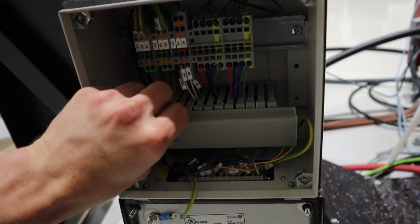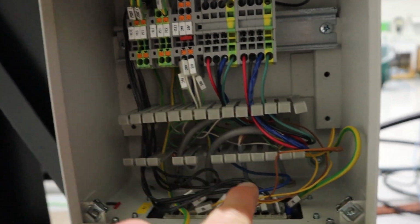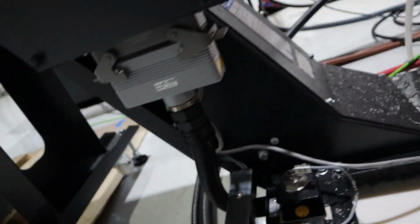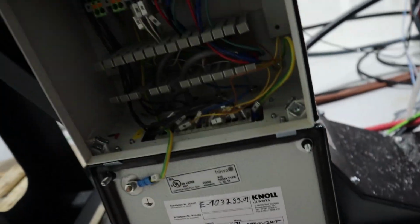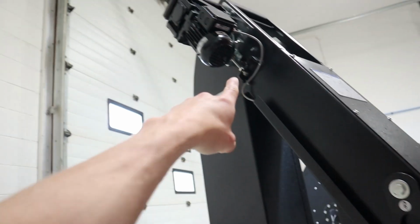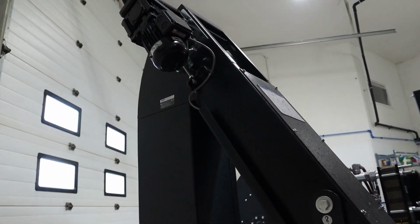But if I pull off the cover that covers the wiring harness, I can see those little white wires end up going to those 2 thinner gray cables, which, if I follow everything down, we have thick cables and we have thin cables. And the only 2 thin cables go to these guys. So it makes sense. The thick ones go to things like the transfer pump and probably that one, the chip conveyor motor. So a lot more power going to that.